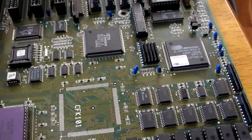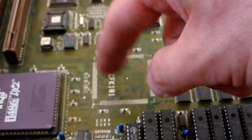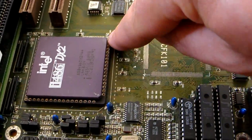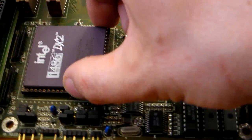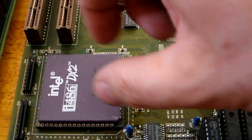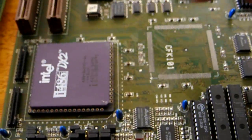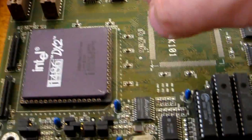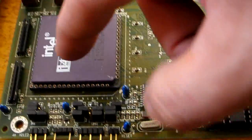On this particular chipset, obviously you've got the 486. A lot of motherboards you'll find have two sockets on the 486, but this board didn't have that. You can see there's an extra row of pins around the actual processor. This 486 can be taken out and you can put in the Intel Pentium 83, or you can also put in the AMD 133. The AMD 133 is going to need the one with the fan on it, made specifically for this board, because if you just stick in an AMD 486/586 133 without that, it'll cook it - there's no voltage regulation on this board. It's designed for an Intel chip.